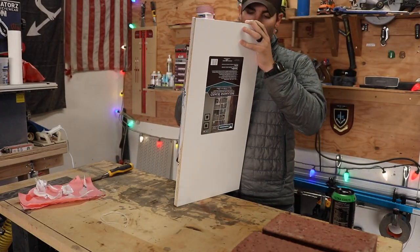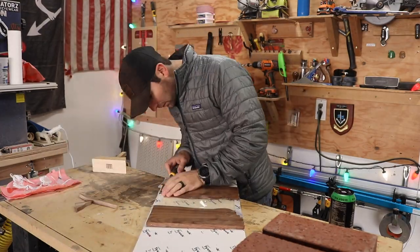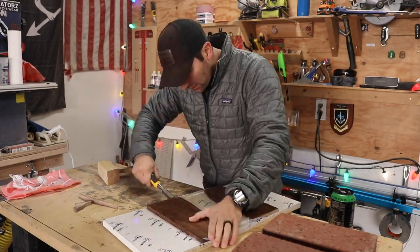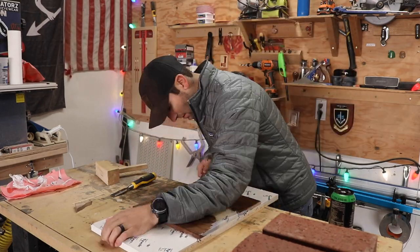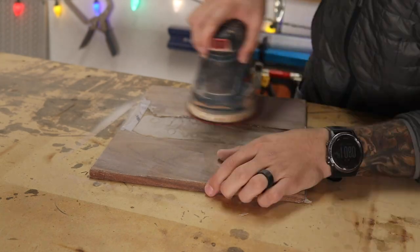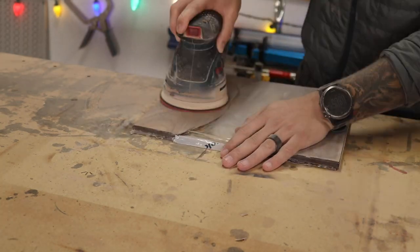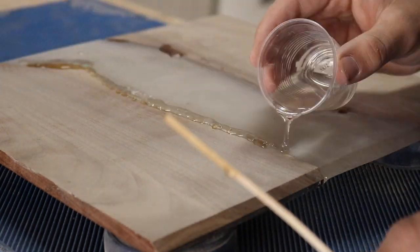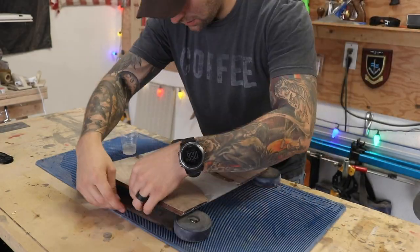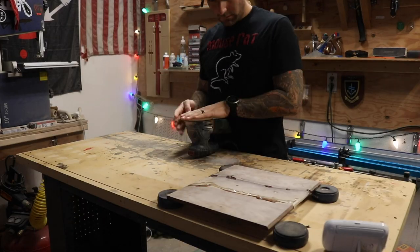This worked out great. I still ended up having bubbles because I'm using the wrong kind of epoxy, but it wasn't so much that it was a big deal, and I ended up sealing almost all of them with a quick small batch. It was a pain to get off the mold though — the best way I found is to just find a little shim and tap it with a mallet and it just pops right open. I mixed up a little amount of epoxy and filled any voids from air escaping or anywhere the epoxy didn't reach. I did this to both sides since each side had small holes and some uneven patches. That Rockler mat is awesome — it makes cleanup so much easier.